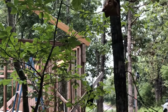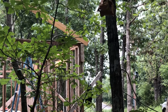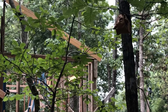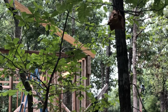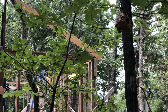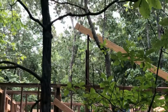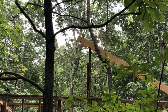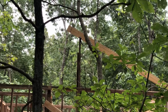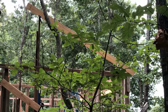I've scabbed on a 1 or 2x4 1.5 inches down and set the tail of that rafter there, and then I've marked all of this on the inside so that I can see, because you're supposed to have at least 1.5 inches bearing load on the bird's mouth. These I might cut the bird's mouth and actually cut them off flush because I'm thinking about doing rafter tails. And then up there, there's a line drawn too, so I know where the ridge board is. So that's my process. So I'll take this down and cut it, and it'll become a pattern for the rest of the rafters.